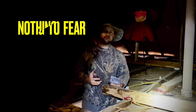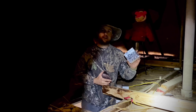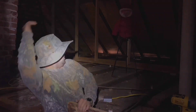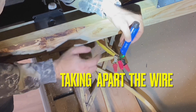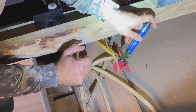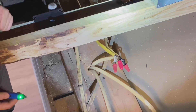There's usually nothing to worry about when you're up inside an attic. I've got my box here. I'm going to bring you in really close so you can see exactly how I'm doing this. What I'm going to do first is check these wires to see if they're hot. This thing will beep red and make noise if there's something hot here. That was just a false reading — the breaker's turned off for this.